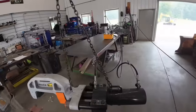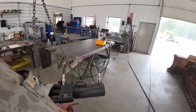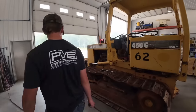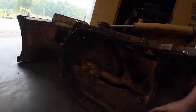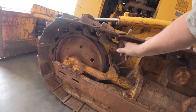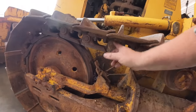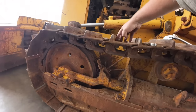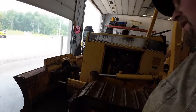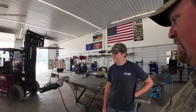All right, we got a track press. You guys have been watching my channel for a while. You've seen us use this thing a couple times. It's made to press these dry tracks. When I say dry tracks, they make two kinds of tracks. I've explained this in the past, but these are dry. So they're just a pin and a bushing in there, no lubrication or anything. The sealed and lubricated ones actually have oil around that pin and bushing, and they'll have that alligator link where the bolts just go through and bolt the track together. But unfortunately, on these dry style rails, they don't have that. So we got to shove a pin out.